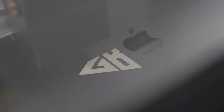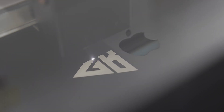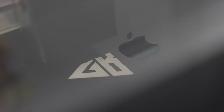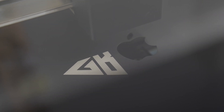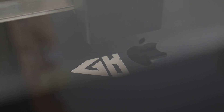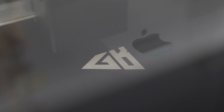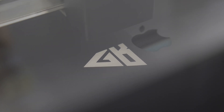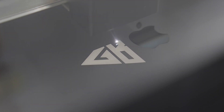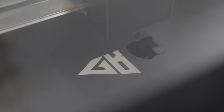The Glowforge Pro has a 45-watt laser and can cut and engrave wood, fabric, leather, paper, acrylic, rubber and many more materials. You can also engrave glass, coated metal, marble, anodized aluminium, and titanium. It uses a CO2 laser tube — a type of gas laser operating at 10,600 nanometers — with XY axis motors allowing the laser to engrave at 1000 DPI resolution.